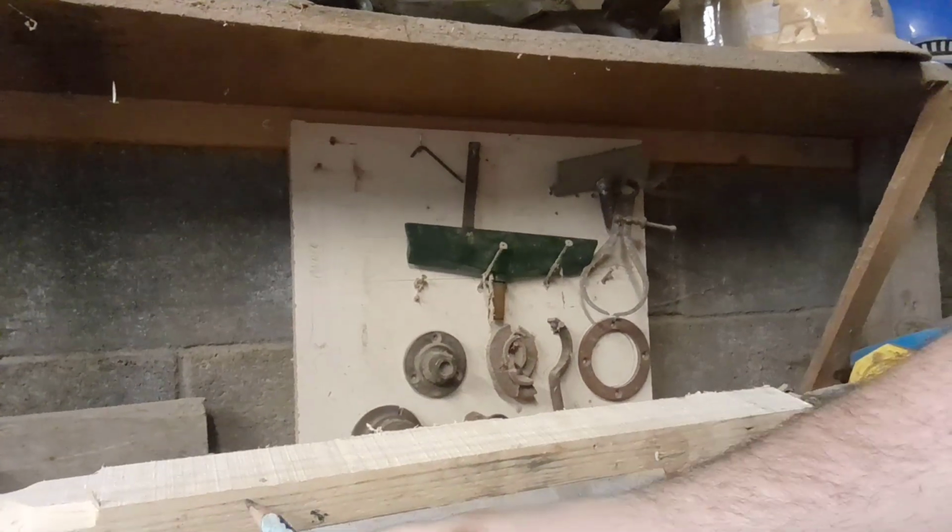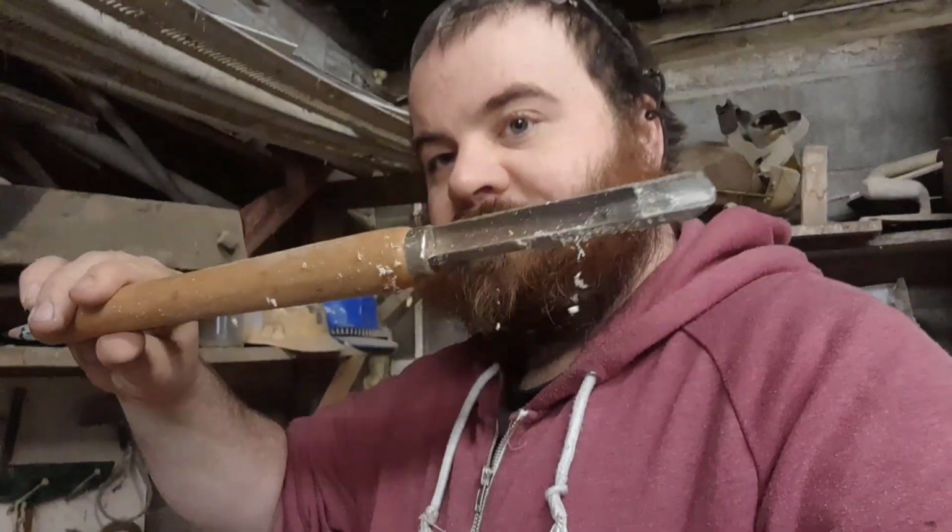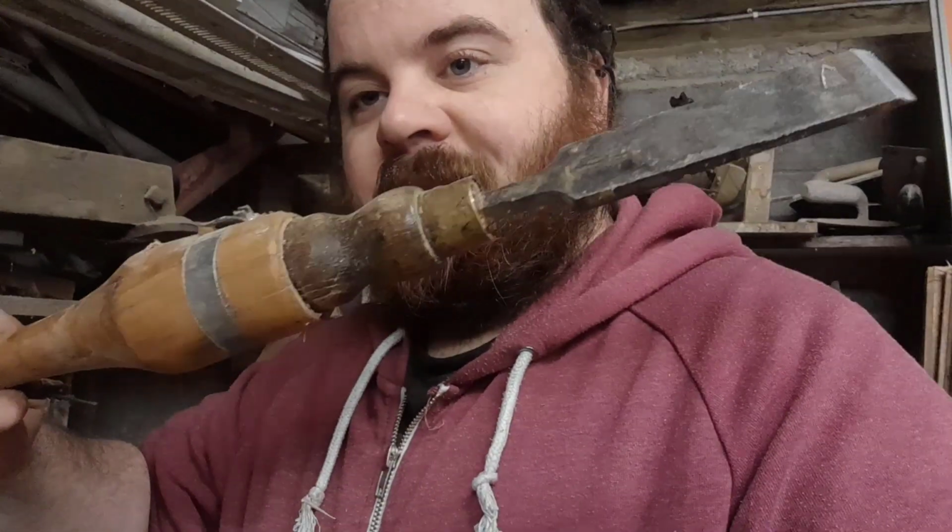So the key for turning is be very careful. You always want to be coming in just slightly below the midpoint with your turning tools. And always use turning chisels, which have really long handles and give you a good grip. Or if you're like me and you own tools in the Victorian era, make yourself an extension handle for a chisel that has steel that's better than any steel you'll ever buy. Didn't buy this. It's my great grandfather's. The chisel, not the extension. I made the extension.